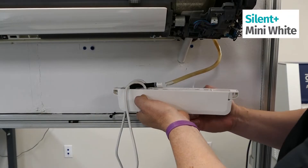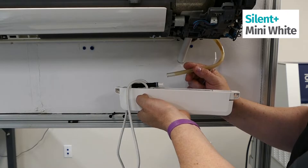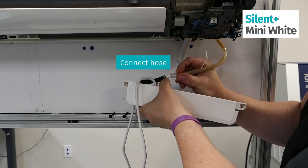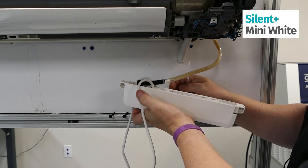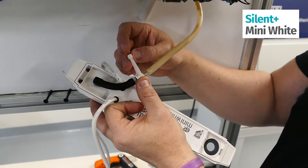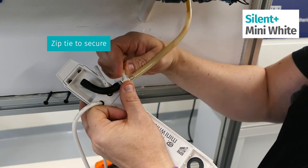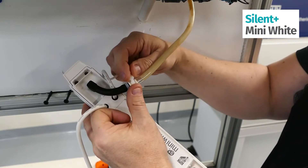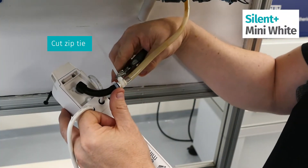I have the zip ties already installed on the line itself. I'm going to take our discharge line and cap it right on top of here — this will slide right on. Make sure you use the zip ties provided in the bag to secure it. Once the zip ties are on, make sure they are tightened so there's no water leakage, and with proper technique make sure you're snipping the ends as well.